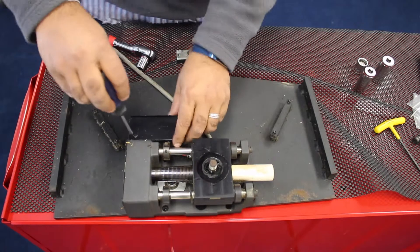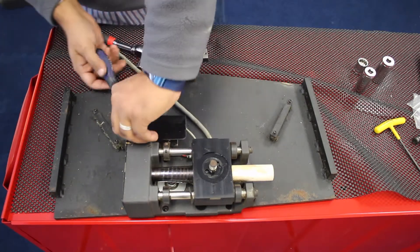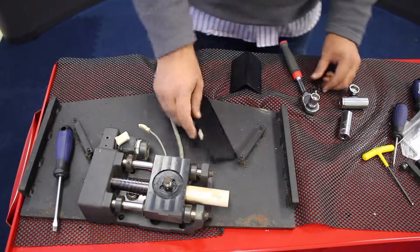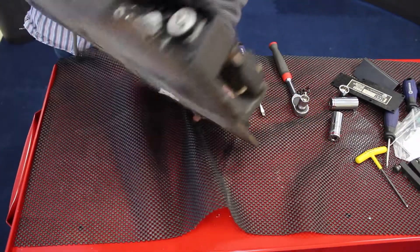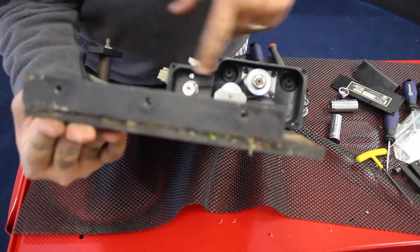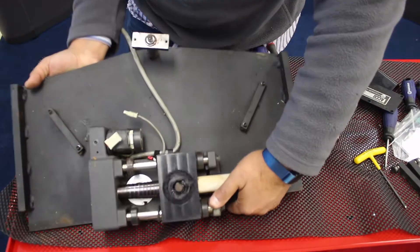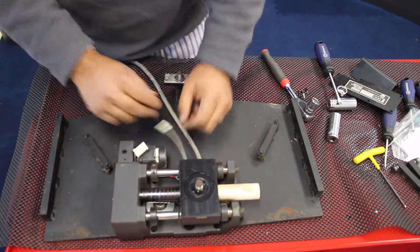We will leave this in place here. This is where the actuator is mounted. This is the old mechanism — there is a motor driving a pulley, a gear reduction there, and that pulley is connected to an even smaller pulley, driving another pulley that drives a lead screw. It's a pretty complicated mechanism. When we go over our retrofit, we will show you how this is being simplified with our system.